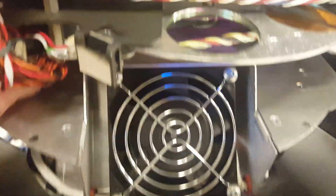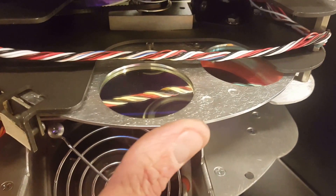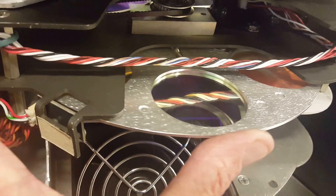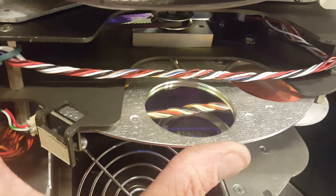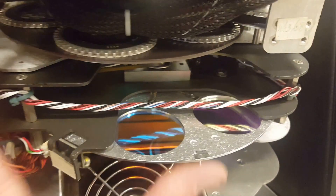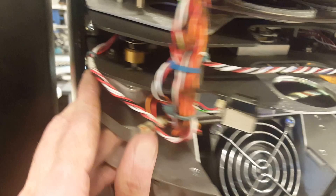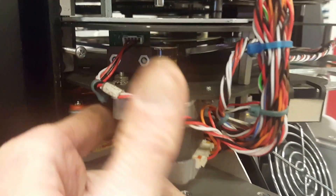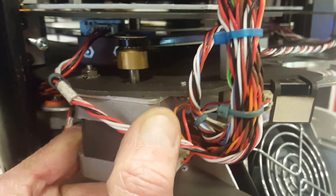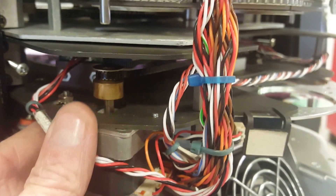If we go on the other side, on the fixed color wheel — this one is a big wheel and the belt is fairly small, which means it can wobble a little. So if you do a fast spinning and try to stop, it may wobble just ahead of the sensor or just behind it, and it will try to find its position again. For this belt, you need to lean against it and then put a little more pressure on it, because it needs to be really tight.